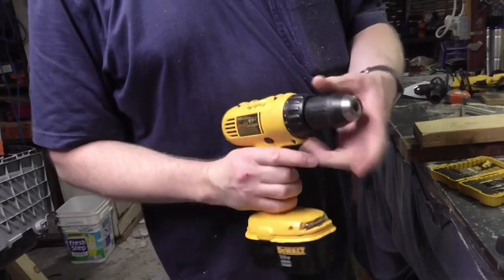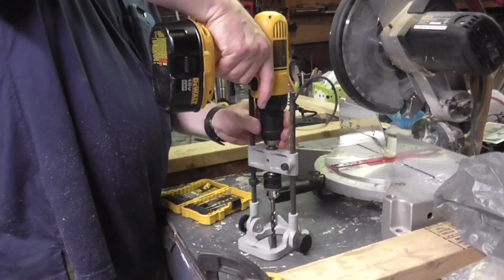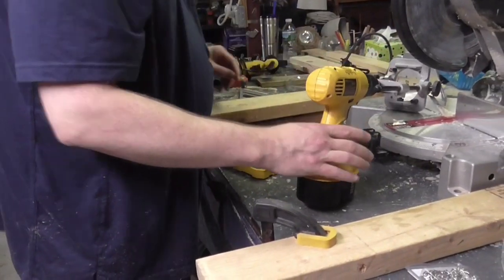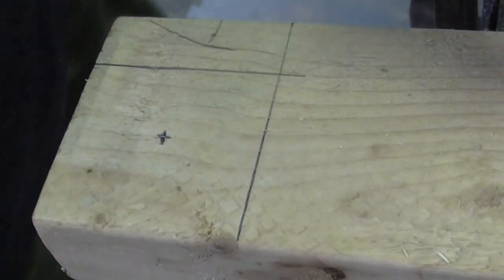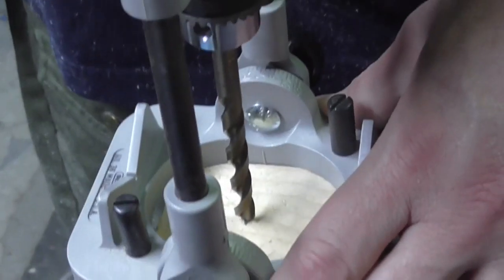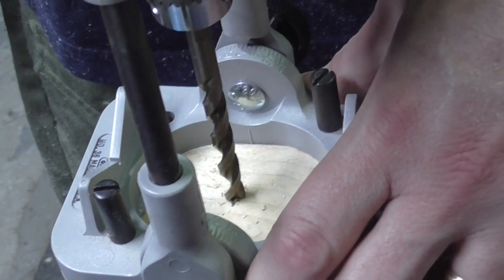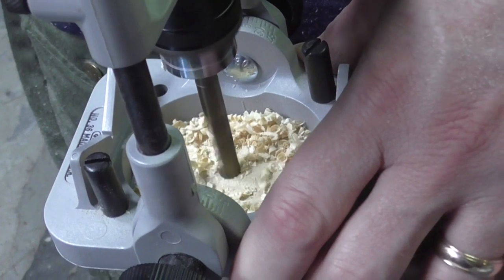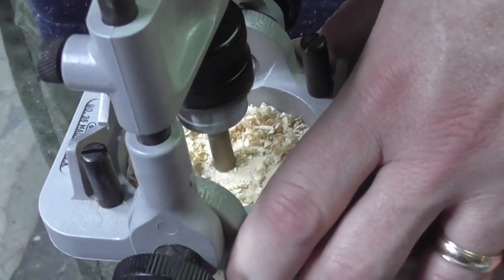You can use a drill press to drill 90 degrees, but you could also just hold the drill, and some drills even come with a level to help you get that 90-degree angle. So after creating the box of the size of the actual wood we are using, we measured to about the center of that box and drilled the hole there. Using a template ensures that the frame and panels have the holes and bolts the same distance apart.